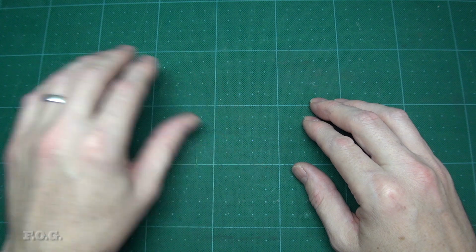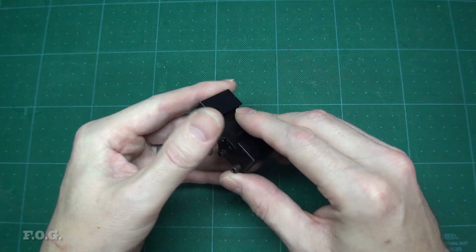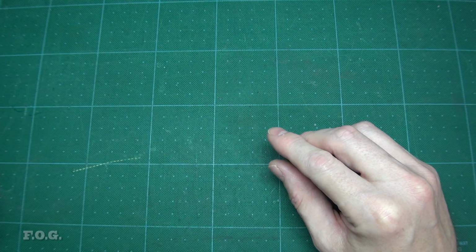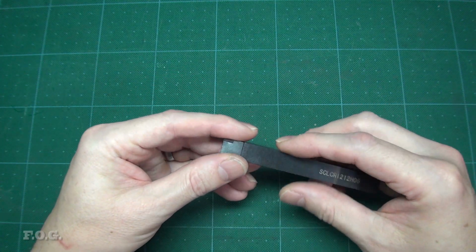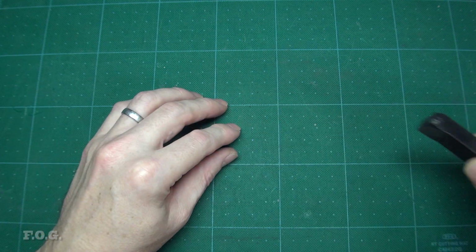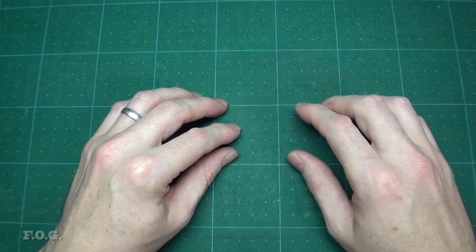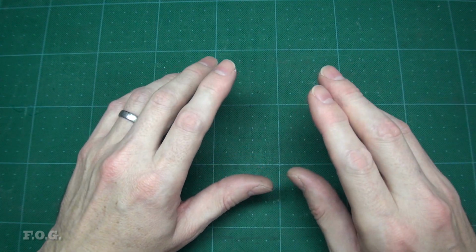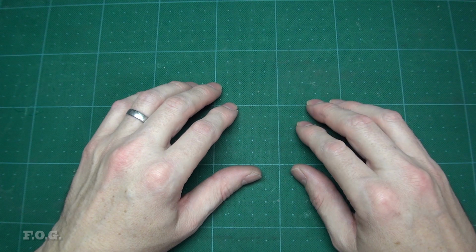Number 3, be careful when purchasing the quick release tool holders, as the dovetail sizes do actually differ a lot. Number 4, these insert type tools do not work with the standard mini-lathe tool posts, so be warned about that. Number 5, if you want to get the metal headstock gears, then be prepared for a huge hassle when fitting them. And also be warned, they are crazy noisy at high speeds.